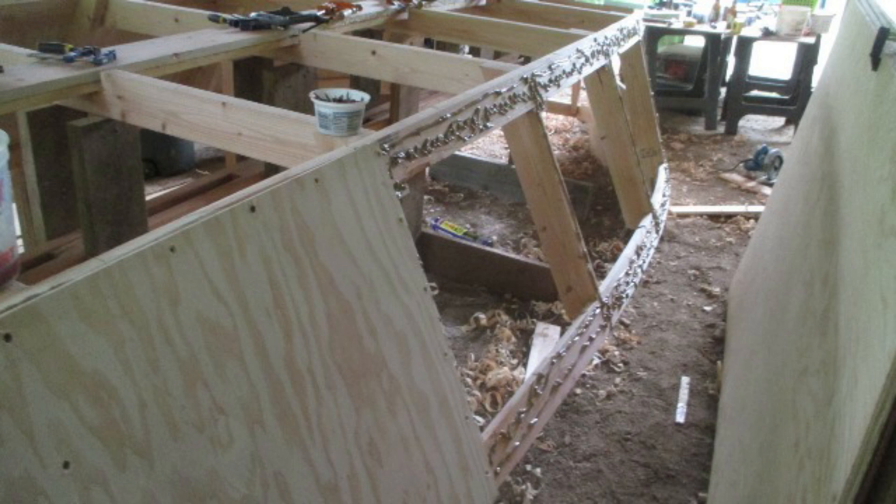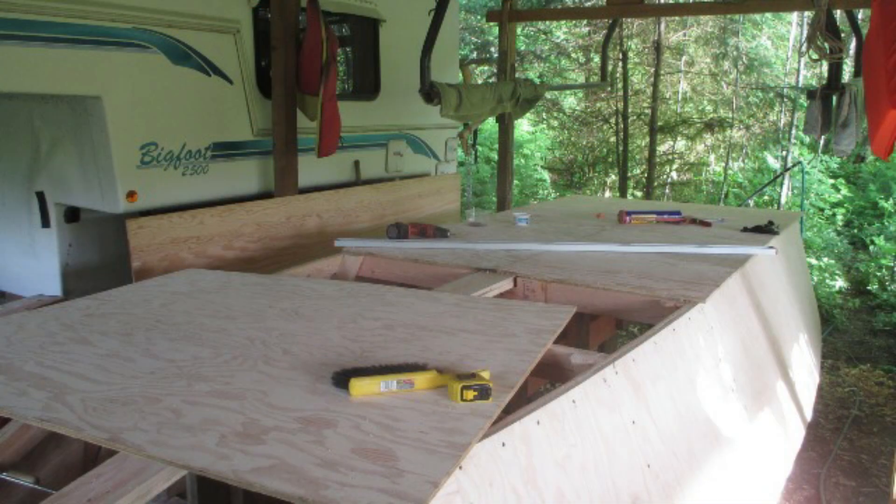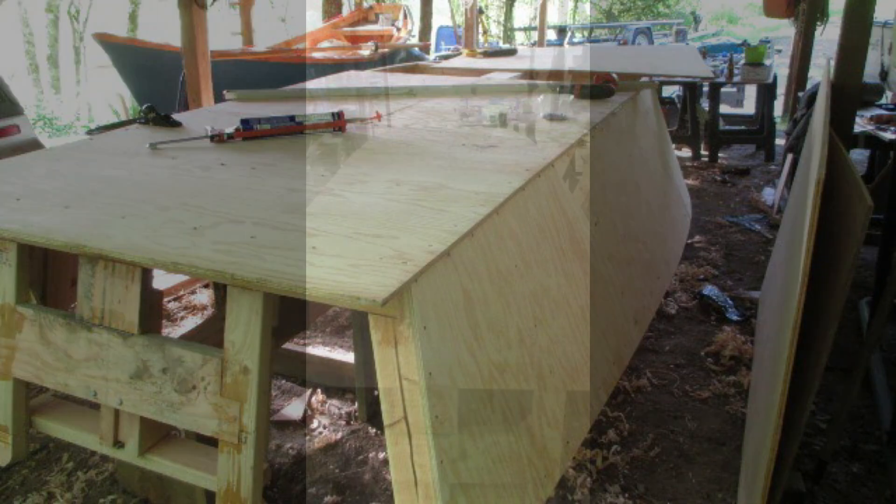I cut three 25-inch pieces out of each of two sheets of 3/8-inch marine plywood and clamped them in place beginning at the stern. The first butt joint is centered on frame 2; all other joints fall between frames. The next day I worked on fairing chines, frames, and keelson for half-inch bottom plywood. The keelson took a slightly different curve from the chines in the bend toward the bow, so I had to plane and sand the keelson between frames.